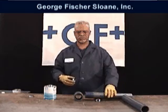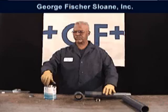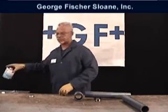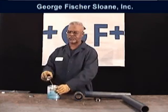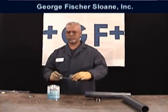While the primer is still wet, apply the solvent cement to the fitting interior and along the primed pipe length. Again, two coats should be applied. The solvent cement is applied liberally while avoiding pooling inside the fitting.